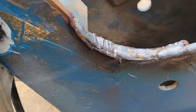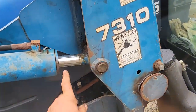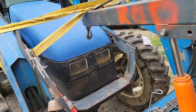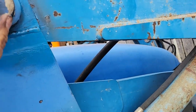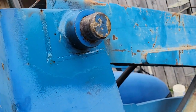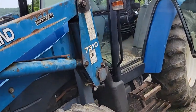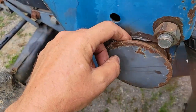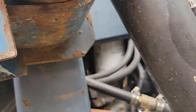There was a looseness on that post where it attaches. We're having a hell of a time trying to line these pins up — I got the cylinder in but trying to get the pins in because we're on unlevel ground. We used the engine hoist to lift the loader a little bit, then used the hydraulic cylinders back and forth, and moved the tractor back and forth. We got one most of the way in but still need to get it in the backside — it's gonna be a nightmare. Got that all fixed. This section was always rattling on this big pin, so I built it up with a little weld and was able to clamp it on tighter.